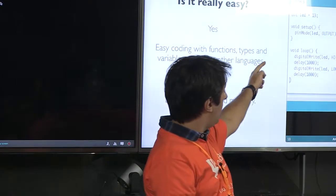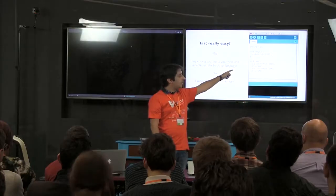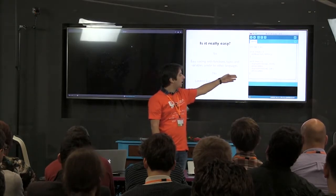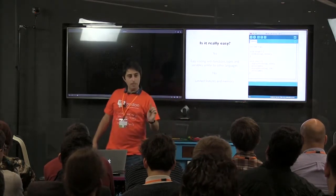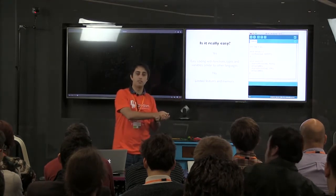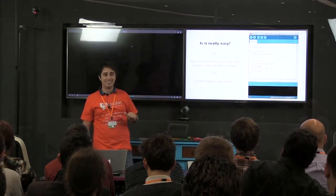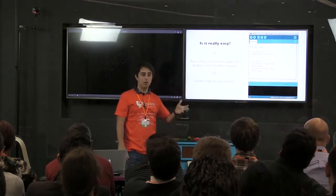And here I did a digital write on the LED, that's 13, high. I'll wait 1 second, and then I'm writing an information again, saying low on the same pin. So what I'm doing is, on 1 pin on the board, I'm having 5 volts, wait 1 second, turn off that 5 volts, wait 1 second. So basically I'm flashing an LED. So this code makes changes in the real world. I'm flashing an LED on my board.